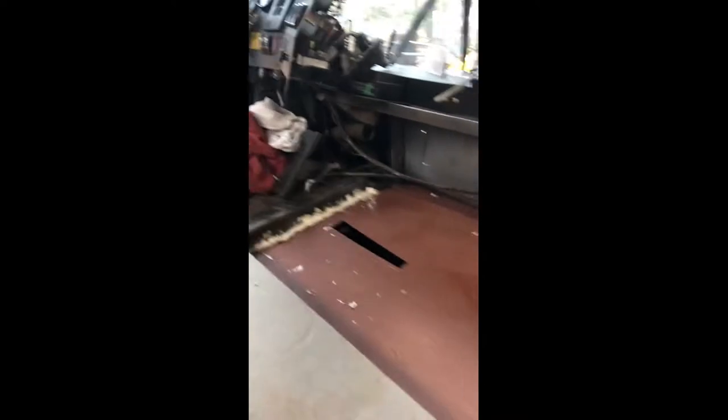All of these connections I was able to take apart. The heater lines came through this little hole here, ran up through here, and then into the unit. I was able to just take those off and pull them out so that I can clean everything. You can see how dirty everything is. I'm trying to get everything nice and clean before I put it back together. I had to stop with my floor insulation at this point in the front because I haven't got the heater back in place.